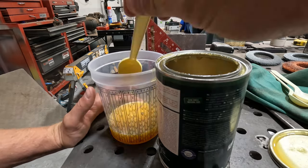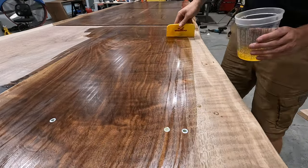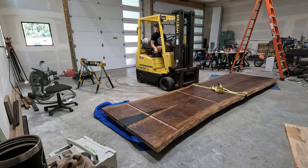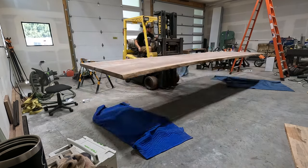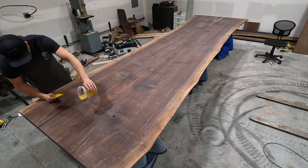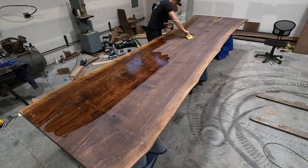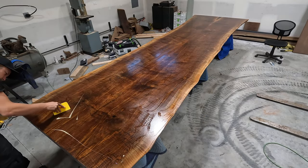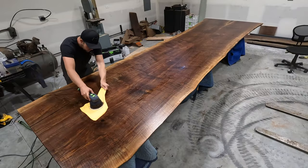Like all my previous videos, I like Rubio Monocoat — it's what I found is the easiest for me to apply and I always get great results. I typically do one coat on the bottom, and then flip it over to do the top side while it's still wet so if I need to fix any marks from flipping it I can. Then I do one coat on the top, let it cure about 24 hours, and come back with red Scotch-Brite on my little sander — that gives you that satin look on the wood, just a little scuff for the next coat to bite into. For that crack we left exposed, I like to flood a little extra finish into it and use compressed air to force it down there so it gets into all the nooks and crannies.